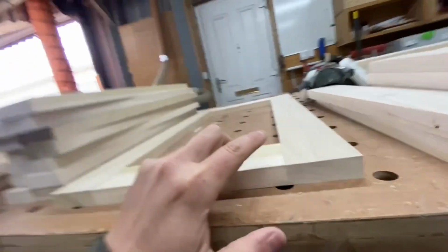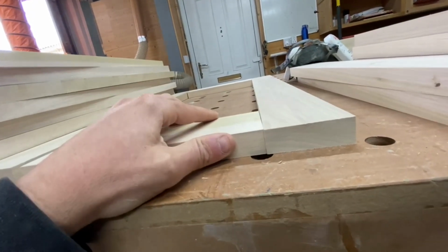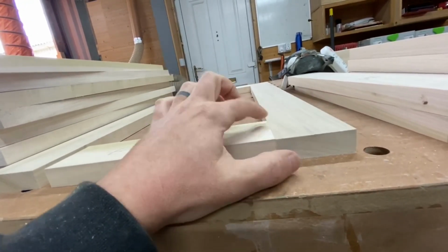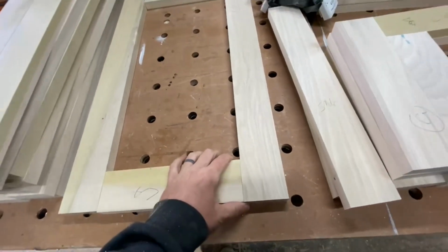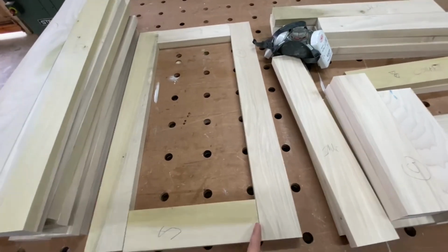As long as you do it out of the same material, in particular if you're doing MDF doors, it's 100% the strongest way to do them. No question in that at all. On this, I can understand people being concerned that you've got a large expanse of end grain going onto through grain, but the reality is, with your panel in there, and I'm going to try and get two dominoes in these, it just makes for better decoration. They're only smaller doors. If I'm doing long doors, I will do either rail and style joints, or long loose tenons. But these are only little doors, so that'll be more than strong enough with good quality PVA and the 6x40mm dominoes.